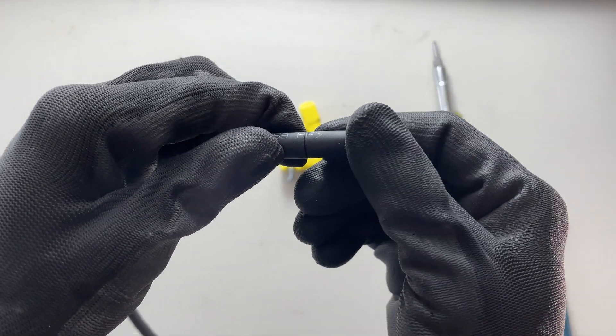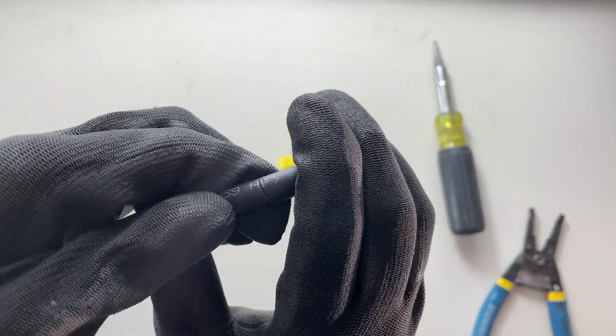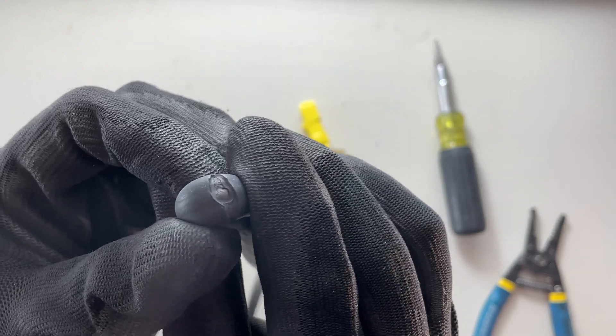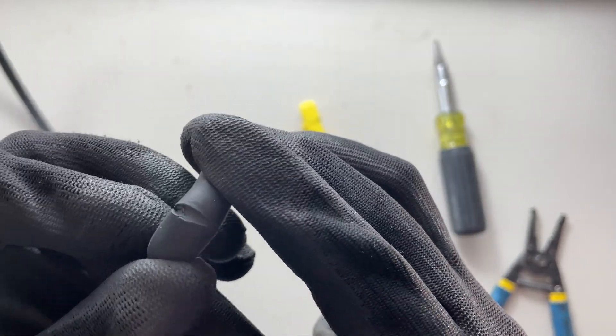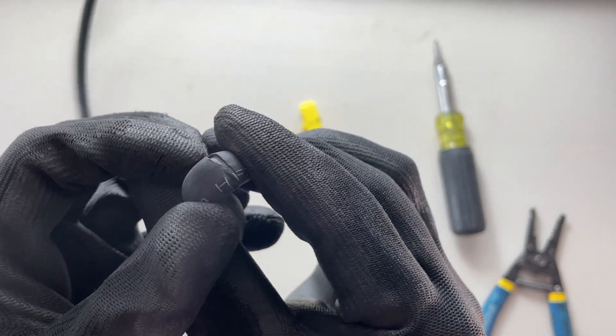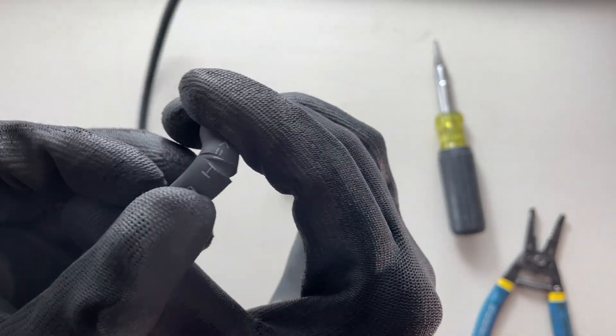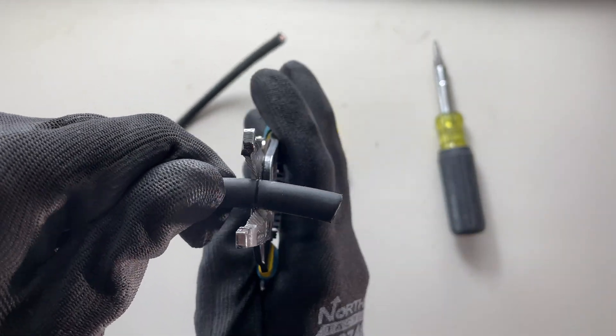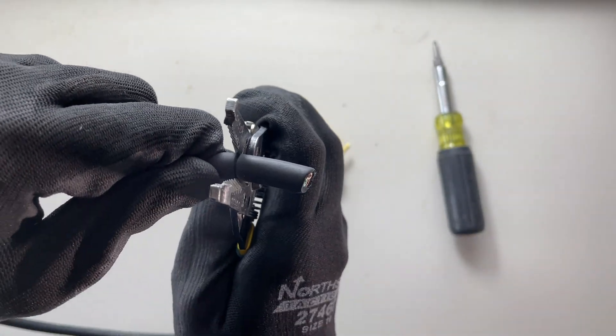So I don't really want to go all the way through on my first go. I just want to go halfway and then look — I look by bending this cable and just seeing how far I went on my first go. I would rather do this two or three times than damage the conductor insulation underneath and have to start over.